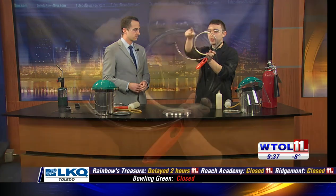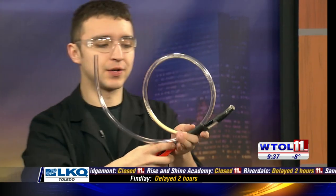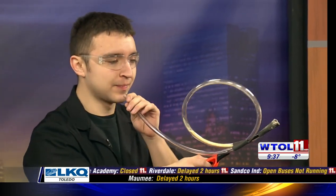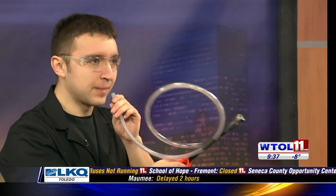What we want to think about is how it is in a sawmill factory where there could be dust all over the place. All those particles could be surrounded by more oxygen. So we built this little device here to show how that same material — lycopodium — inside of a tube, blown with air, will be more oxygenated. And if I point it this direction... you can see that with more oxygen, you have a much more dangerous situation.